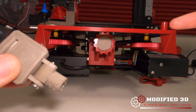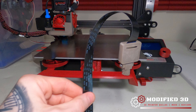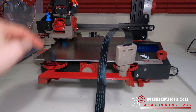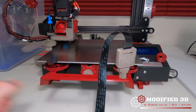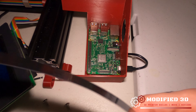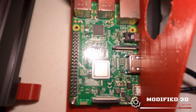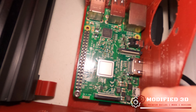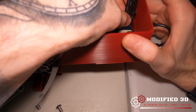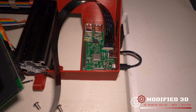This just slides right on to the little post — that's where we mount the camera. Now that we've got the camera mounted, we can go ahead and attach this end of the ribbon cable to our Raspberry Pi. My Raspberry Pi is mounted behind the LCD screen, so I'm going to have to take that off. We'll do the same procedure to install the ribbon cable on the Raspberry Pi end. There are actually two areas for ribbon cables, and the one up top is labeled 'camera' — that's the one we want.